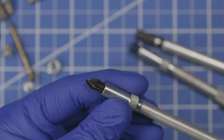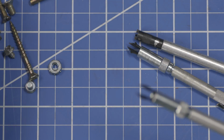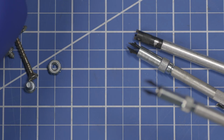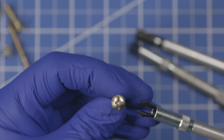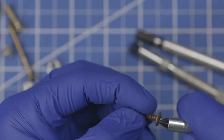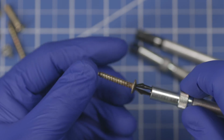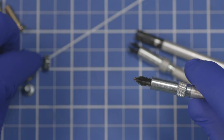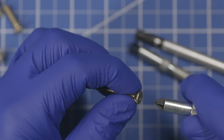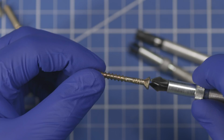And this design is really designed for Phillips head. It doesn't work with much else other than maybe a combo headed screw, where you're using the Phillips part, but it works fine in there. However, if you're dealing with Robertson or square drive screws, like this one, for example, this isn't the best choice. It'll hang on a little bit, but it's not tight.